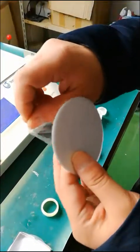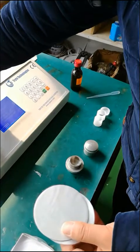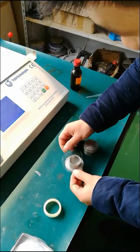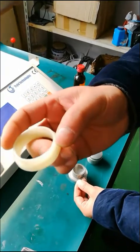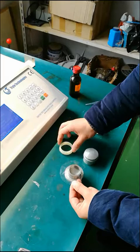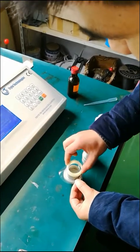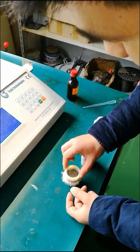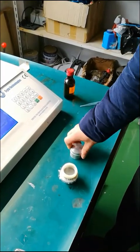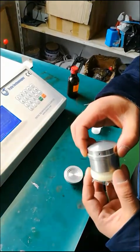There are two mylar films. Put the opaque one aside first. Select the transparent mylar film and place it on the steel ring. Then press the mylar film with the oil leakage proof outer ring — pay attention to placing the groove part of the outer ring upward. Place the mylar film in the middle as far as possible, then press it down. Make the mylar film as flat as possible, then place the anti-oil leakage pressure block on it and press it down hard to take out the outer ring successfully.